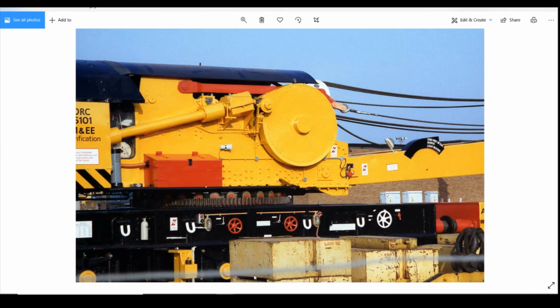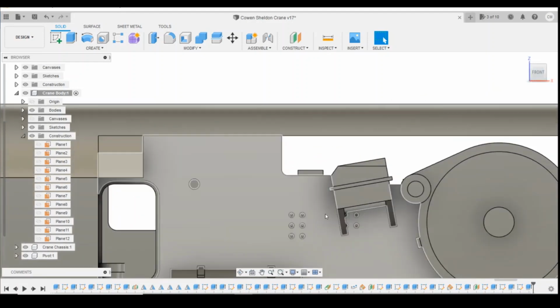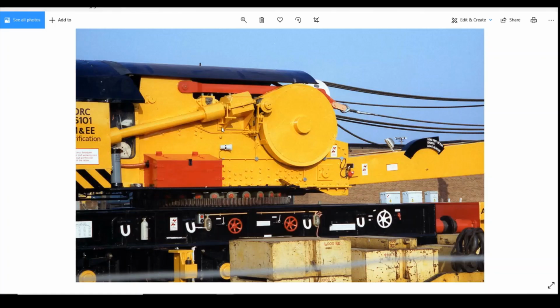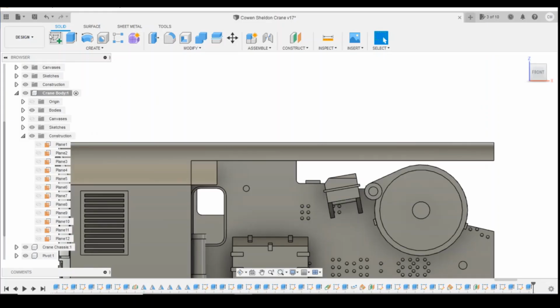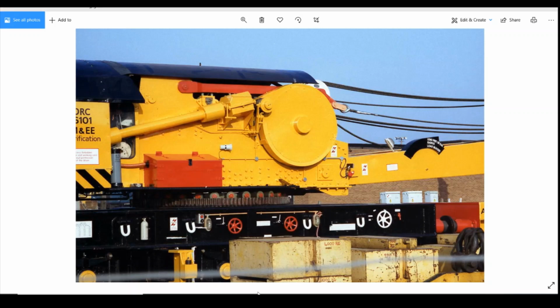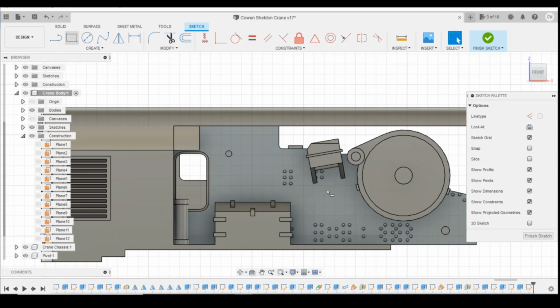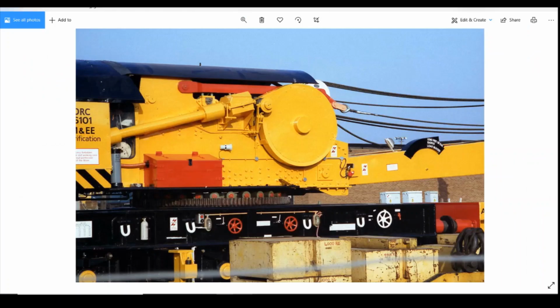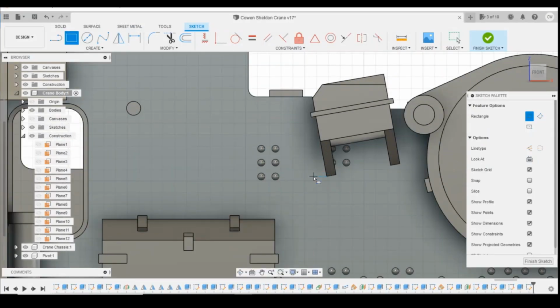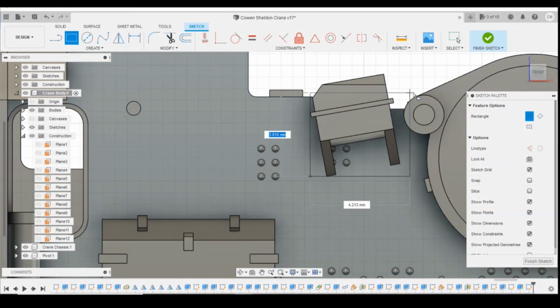Okay, so the back plate we can now draw on, that's going to be relatively straightforward, because that is, if you look at it, horizontal and vertical to normal geometry. So if we create a sketch onto that surface, this back surface, I'm going to use a 2-point rectangle. Okay, so it's going to be level with that height there, and just make sure we cover what we need.